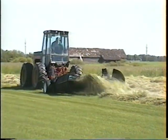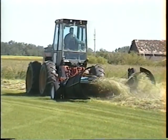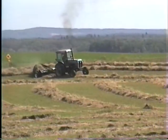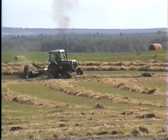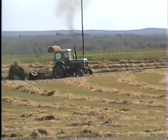The normal workflow on grass hay is similar to alfalfa. Cut today, recondition today or tomorrow morning. If you have a brownleaf problem in Timothy, conditioning may be repeated just before baling.